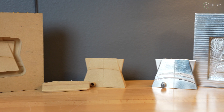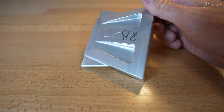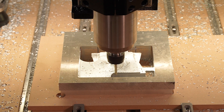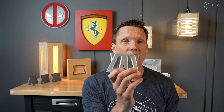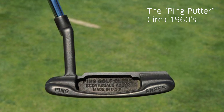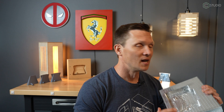The rule of three is in effect in this project: anything you're making for the first time will take three versions to refine and get a quality part. This first aluminum version ended up with some lines that had to be corrected in the software, and I hadn't gone down past the entire face so I had to file the bottom. But the flip worked, the mounting hole developed well, and for a first cut in aluminum, it was pretty darn nice. We're also losing a ton of time and weight with these back cutouts. This design comes in at 295 grams — historically a good number, but nowadays you're looking for around 350. You can easily add weight with brass inserts, tungsten and epoxy, or alter the design entirely.